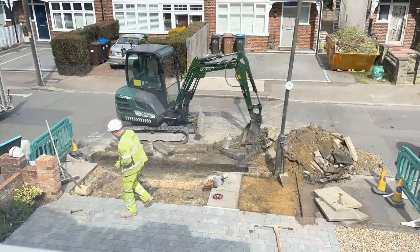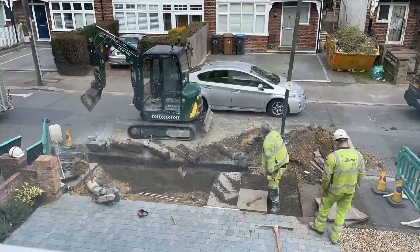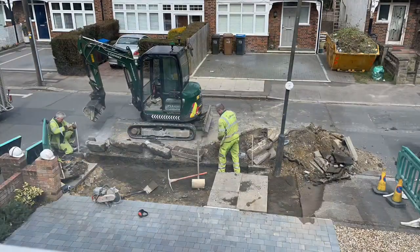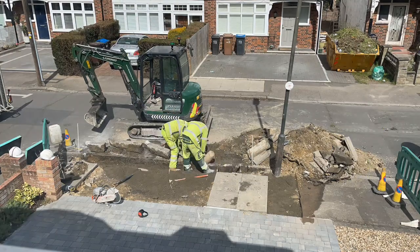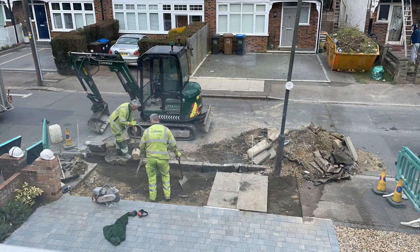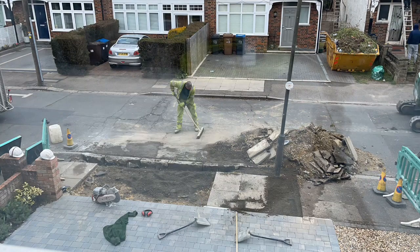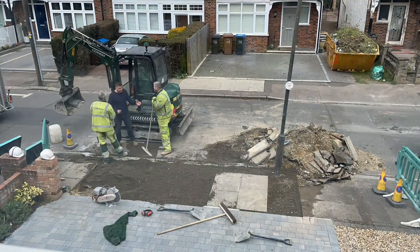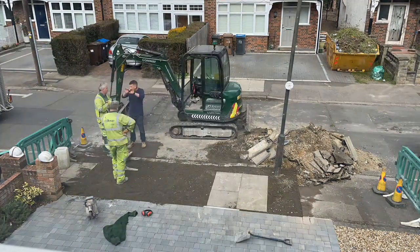As mentioned before, you can't have the drop-down within one metre of the lamppost, so they had to prepare the area around the lamppost and reinsert new paving slabs to stop that section being driven over. The kerb was actually kept at full height alongside those four paving slabs next to the lamppost. Then some more prep work getting everything ready and putting down some base materials, in advance of applying the tarmac that's going to go over the top.